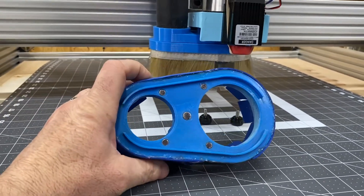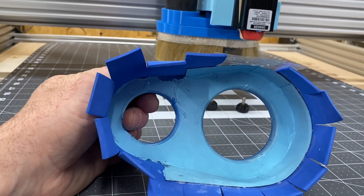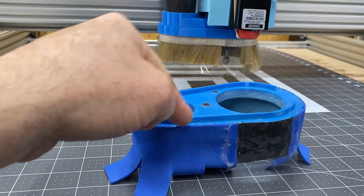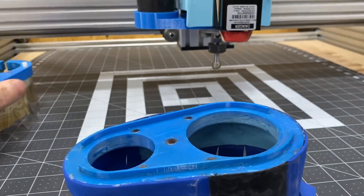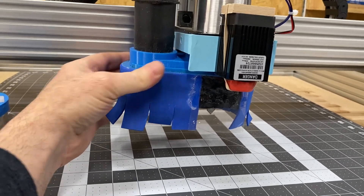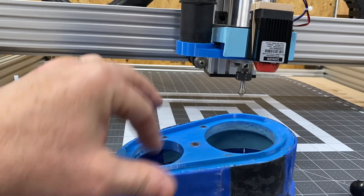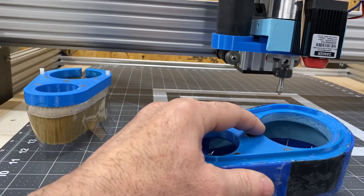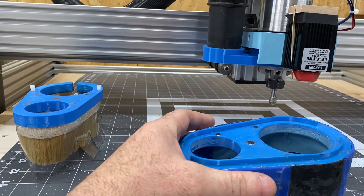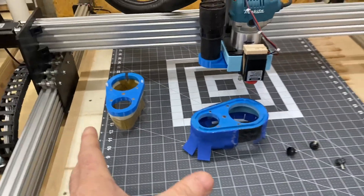In version two, because the bottom is flat with no trench, I was able to use it as the bottom reference of the 3D printer bed and print upward, which allowed me to add a rounding wall. This rounding wall holds the shoe in place against any shear stress on the magnets, so the magnets are constantly experiencing upward force without left-and-right lateral force that could pull them off and lose the shoe mid-route.